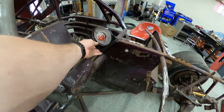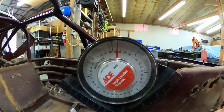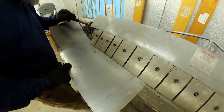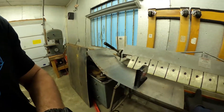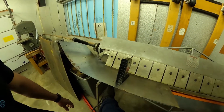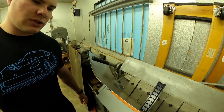We're making a lip for this right now. What we're doing is putting our angle finder on here — we're seeing that our angle is about 54-55 degrees. So we're going to go back to the bender. We set our angle finder on the metal like that, then we're going to pull that bottom lever and bend until we reach our angle — 54, 55.